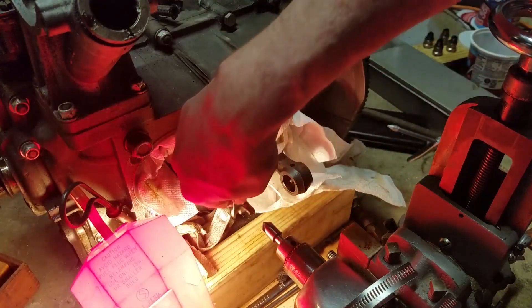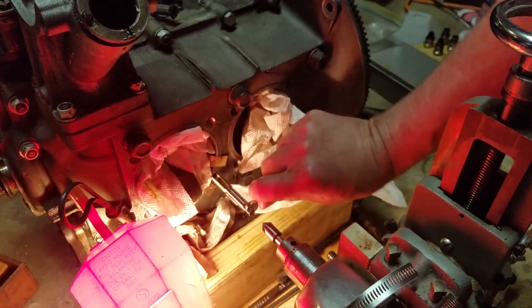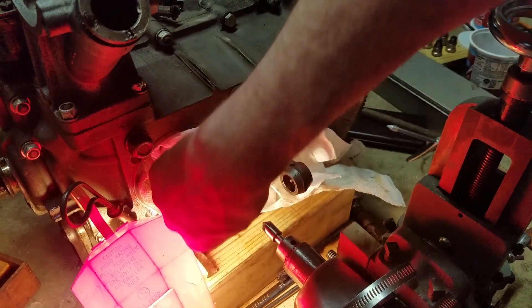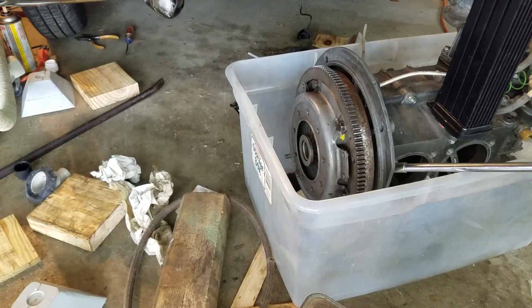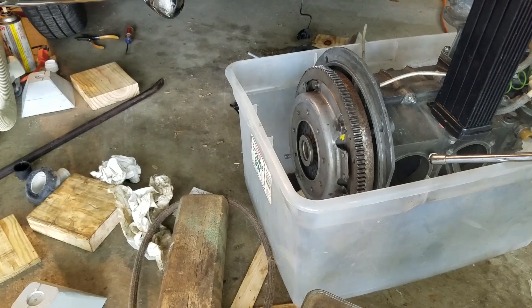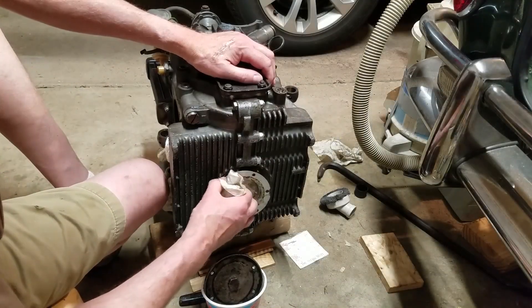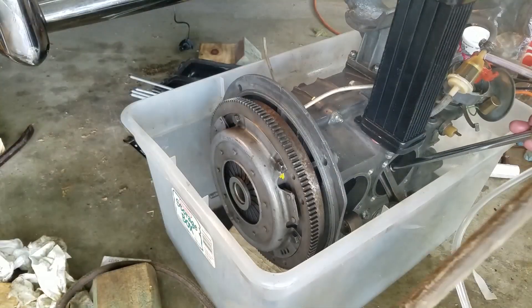After the first couple of holes, I can drill and tap a hole about every 30 minutes — so this isn't a fast process, but by taking my time and triple-checking everything, I don't screw up any of the holes. Next, I clean the inside and outside of the crankcase very thoroughly, using a pneumatic solvent sprayer and some mineral spirits to clean every hole and flush out the insides. I had removed the oil strainer earlier so the solvent and any chips can easily be removed.